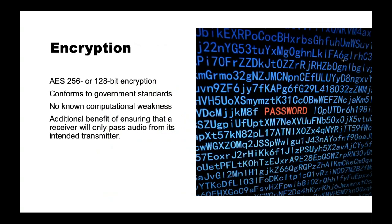Encryption is really popular on digital systems because implementation on analog is very complicated. On the digital system, the signal is always encrypted — it always has a password, just like a Wi-Fi signal. You can see many Wi-Fi networks on the air, but without the password you can't get in. Same thing with the microphone: if you enforce encryption, only receivers that have been synced with your microphone will get the audio. This gives a lot of security, especially for boardrooms, important meeting rooms, and courthouses.